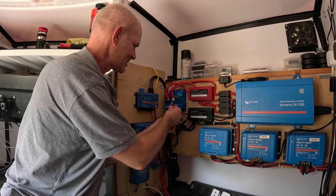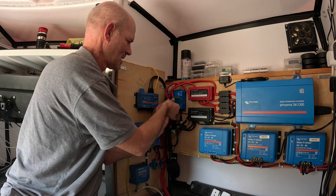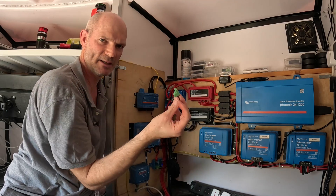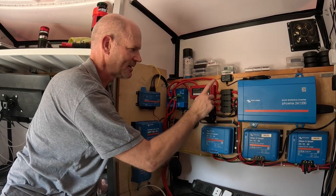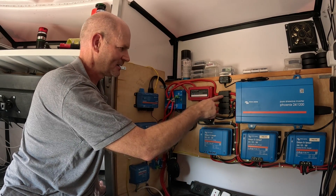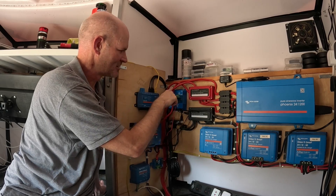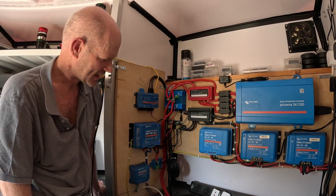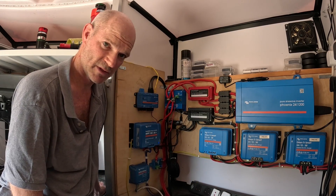There's the link cable done. The fuse is back to normal, both terminals are tight with the cover on. The battery supply and power cable for the unit are connected. I'll leave the output enable key out for now because I want to set it up first. All terminals are back in, the new cover is back on. The inverter supply is now coming off the input - direct from the battery - and then the output of the smart battery protect goes to the distribution block which feeds the three circuits. The inverter is turned off.